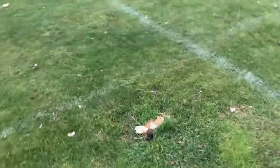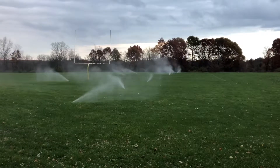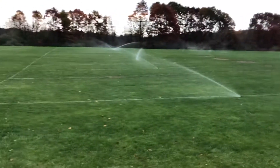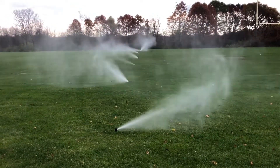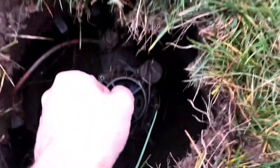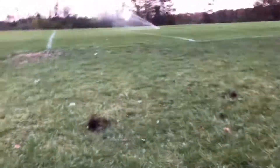Another zone, another zone — there we go, we've switched automatically. Now I have an issue: a valve that's not opening electronically. So I'm going to hit the bleeder valve to see if I can get this zone that's not working to come up so I can get the water out of it. There it is — got it.